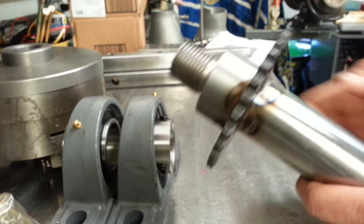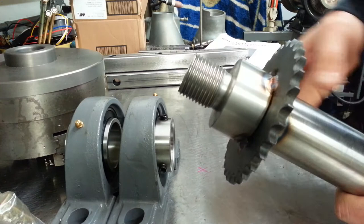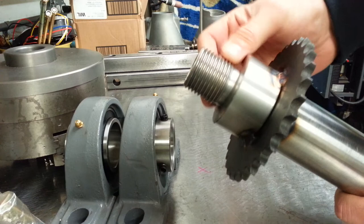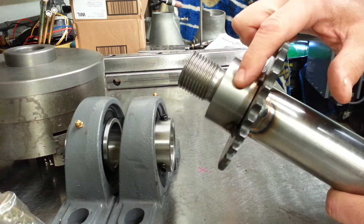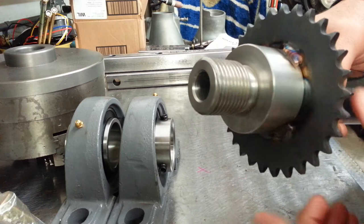This is the spindle assembly with the sprocket. You buy the tube — it's a two-inch DOM tubing from McMaster. The spindle you can machine yourself; however, I had Ryan make me one because my lathe does not have threading capability. You weld the sprocket on to both the spindle spud and the tube itself. The sprocket you again get at surpluscenter.com — I think it's like 10 bucks.